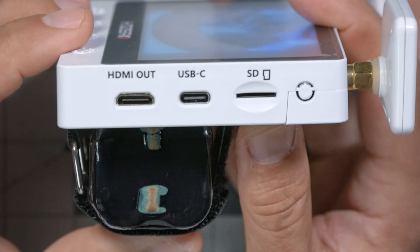On the right-hand side of the unit, there is an HDMI output, and thankfully it works the same whether the signal is digital HD Zero or analog. So if you're looking for a way to receive an analog signal and transmit it to a modern display or an HDMI recording device, this is a possible solution. This has been one of my favorite features of the HD Zero goggles. Way back before we had digital FPV systems, it was a real hassle trying to record analog video. Analog goggles all had DVR, but it was kind of crappy and low quality. Now that systems like HD Zero retransmit analog over HDMI, we can use HDMI capture cards to record analog with no degradation in quality — or just run it out to a bigger screen.